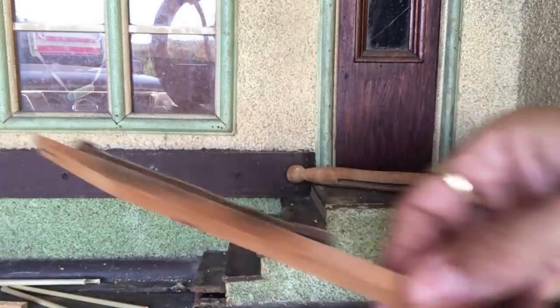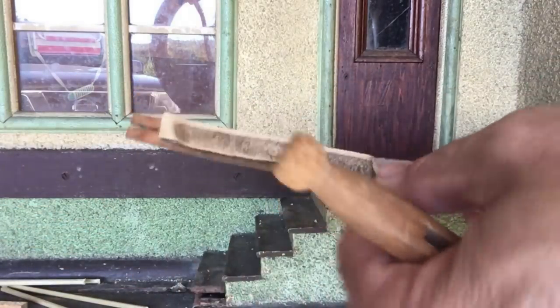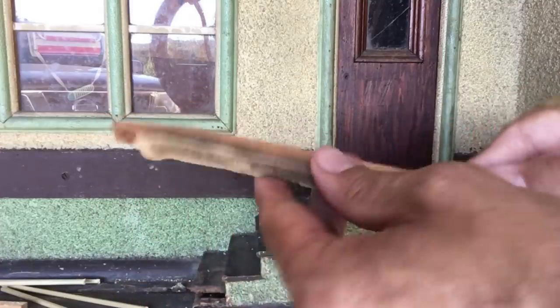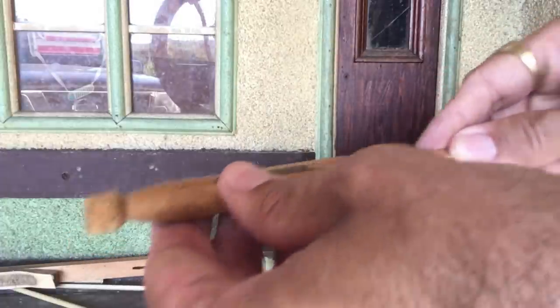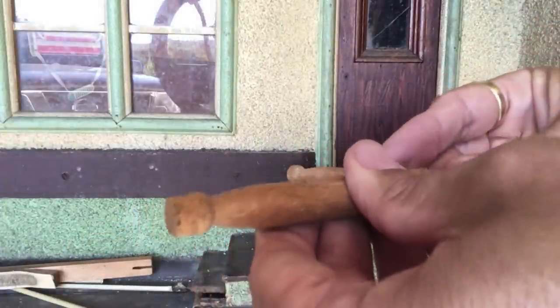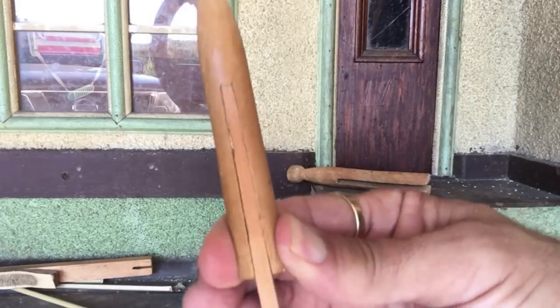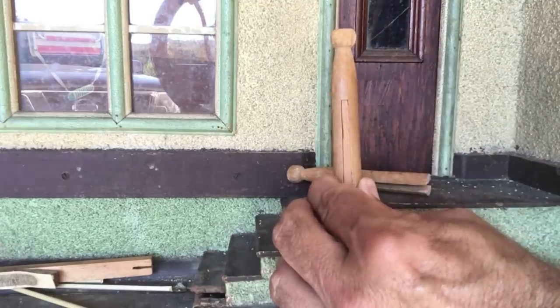So I've told you that I do a lot of restoration on old pump organs. This is an old pump organ part. That's the old leather. This goes under the key, and this is what covers the reed. And so I have some extras. So I split these in half and then sanded them down. And then these pieces, this might not be the one. Okay, so these will go up in here. And I will glue those and we'll seal that up so we have a solid. I could just put wood filler in there, but I'm repairing it the way the builder did originally. Okay, so then these will go here.